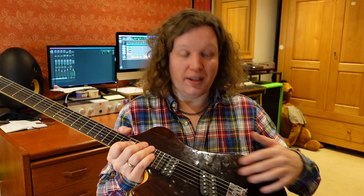But when you wire them together, of course, it doubles that. So the bridge pickup was reading at just shy of 15K. Now, the first thing I actually noticed about the bridge pickup when I plugged it in and played it was that it was wired wrong. Now, I don't know whether Bare Knuckle made the two pickups slightly differently to each other or whether it was a mistake or whatever, but Nathan's wiring in terms of the colours of the wire from the pickups was dead on. But the second coil of the bridge pickup was wired out of phase to the first.